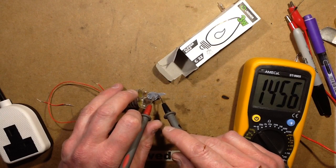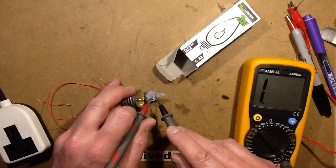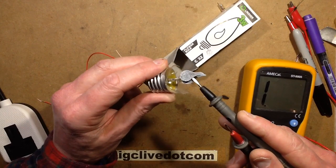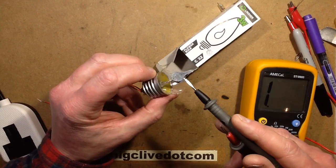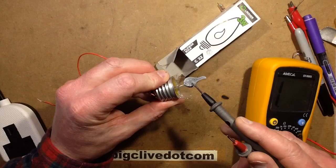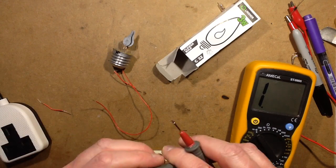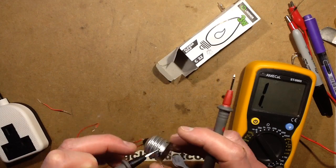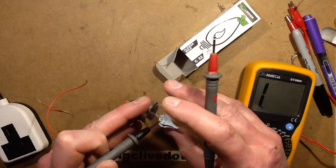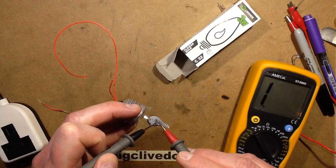The other side is more conductive, but not that much more conductive. I'm guessing it must be down to having some sort of surface that actually changes its resistivity - you know, like a thermistor that increases its resistance as it heats up. And that also helps create the flickering effect. I could swear this has also changed colour since I opened it - I think it might be oxidising. But certainly I was expecting both sides to be slightly conductive, and they kind of are. That side is somewhat less conductive - it must have a sort of insulating layer sputtered or sprayed onto it.